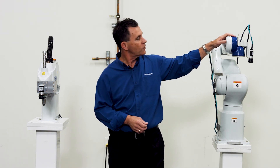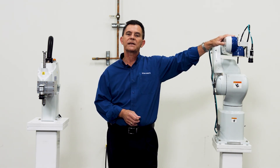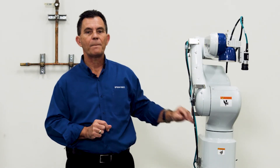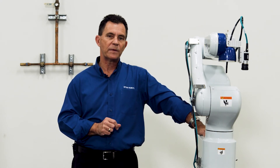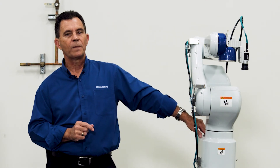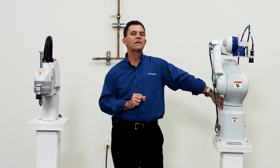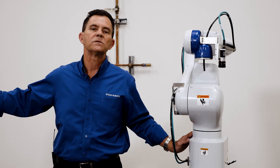We also have a camera bracket on this robot, designed to work with the cable management system. We also sell HyFlex cables that go along with the vision system, so everything that goes to this robot is built for factory automation. Notice the size and footprint of this robot — it's relatively small for the payload it can handle. But more impressive are the moment capabilities of joints 4, 5, and 6. In real-world applications the tooling on the end of the arm gets large quickly, or you might have significant offsets, which is not uncommon on six-axis applications.